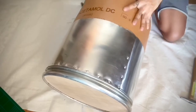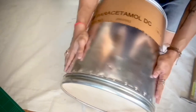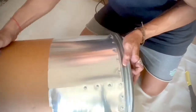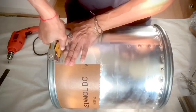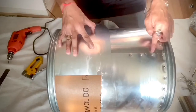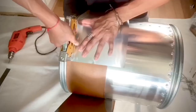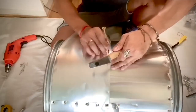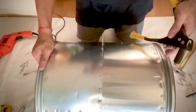Now the lower part is done. You can see it has some scars — I just messed it up, but that's part of DIY, right? It's not that bad overall. Moving on to the upper part — at first I wanted to put the aluminum sheet in the same direction as the lower one, but after making many scars down there I just did it randomly. I also cut off an inch on some sheets to make it more interesting. The riveting felt like it would never end, but here it is — the body part is done.